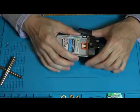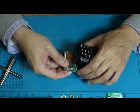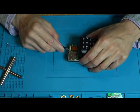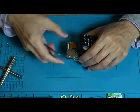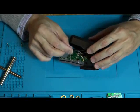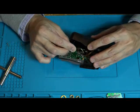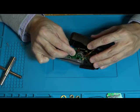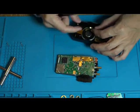It is a friction fit because of the O-ring. Now you can see he's been careful not to put too much pressure on the ribbon cables. He's going to remove the large ribbon cable first — just pop that connector open on both sides, and once you've done that the cable will come out very easily. Now he's going to do the smaller cable, which is towards the top of the radio. It's a very similar connector, just a little narrower. He's popping both sides of that, and once he gets the connector open the ribbon cable will come right out. He's got that separated now.